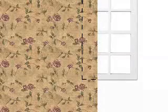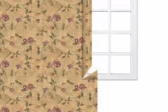When your sheet falls up against a door or window, lightly tuck the sheet into the crease of the frame with your plastic smoother. At the top of the door, or top and bottom of a window, find the point where the side and top or bottom of the frame meet. At this point, take your razor blade or snap knife and make a cut from the point towards the door or window opening. Pull the paper away from the woodwork so you don't cut it. This is called a relief cut.